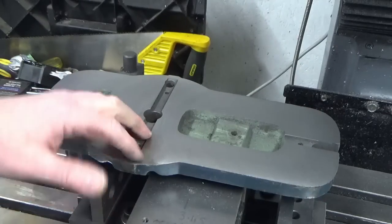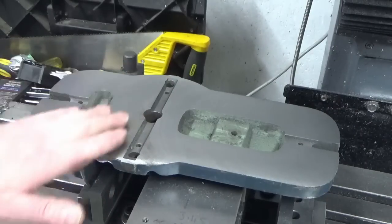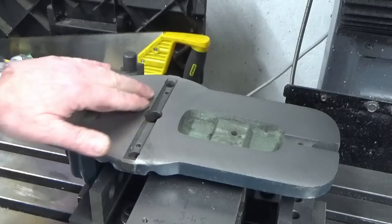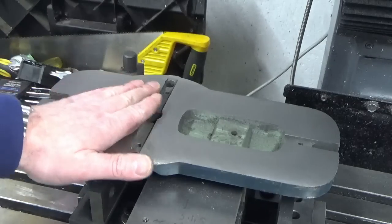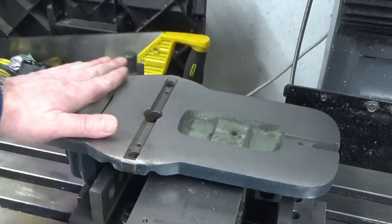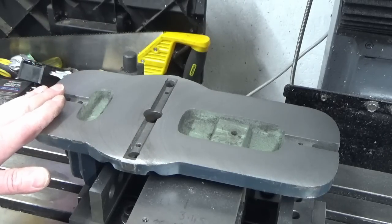There's a couple of hard spots. There's one here, there's one here, there's a bit of a hard spot here where it's still skating a little bit, but it has got under the skin. I've just honed the tool up, brought a nice fresh edge to it. I've dialed in another 2 thou, and we're just going to take our final pass and see what we look like.